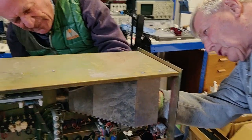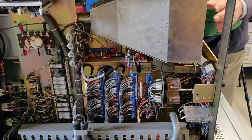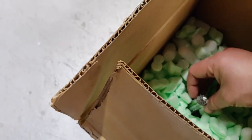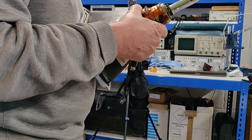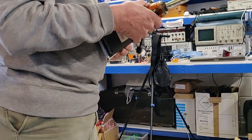Once the tube's mounted up, which is fine. Yeah. Okay, well, that's much better. Now, how do we know where it's got to be on the tube? That's an interesting issue. I wonder what determines where it sits on the tube itself. Have you got some scan coils on it? Looks like it. We should change the scan coils over, because they will have been set up for this. Oh, you think? Good thinking.